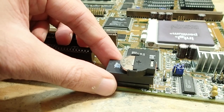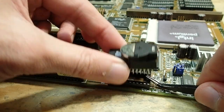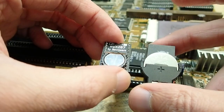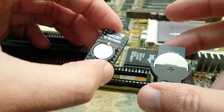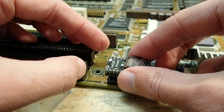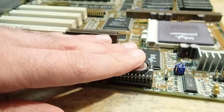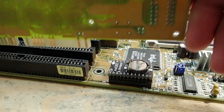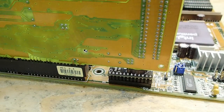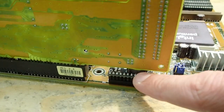What can be done about it? Well, I could put the CR2032 on wires and remove it from the top of the RTC module, but fortunately I have this. If you watch my channel regularly, you will remember this RTC module replacement, which I introduced some time ago. We can now simply replace the original RTC module by this NW3287, and it should be low enough, so using long ISA cards would be possible again. And as you see, it is a perfect fit.